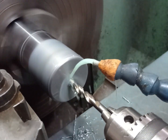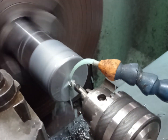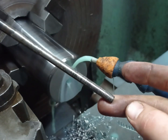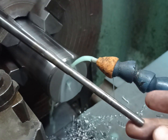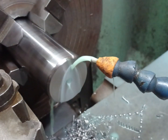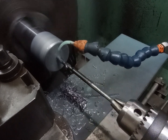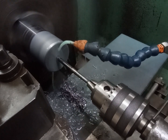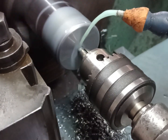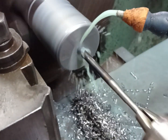I didn't have a long enough drill bit to get to the center of the pin, so I'm going to use a very dodgy one I extended using a bolt. Because I extended the drill bit, its flute was still as short as the original drill bit. Therefore I had to keep extracting the drill bit to remove the shavings while drilling.